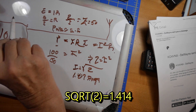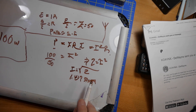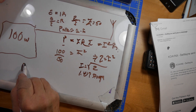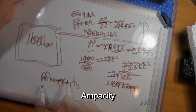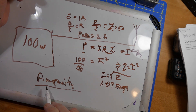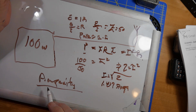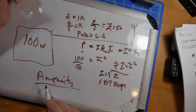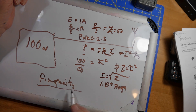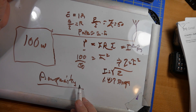So this is your 100-watt radio. If you were to go up to a higher wattage radio, you'd have to get something a little stronger. Now we introduce a new term called ampacity — it means the current-carrying capacity of a piece of wire in amps, because the voltage is presumably taken care of by the coax. You can run 1,000 watts through RG8X, but there's a point where the conductor will start to get warm, and that's called the ampacity.